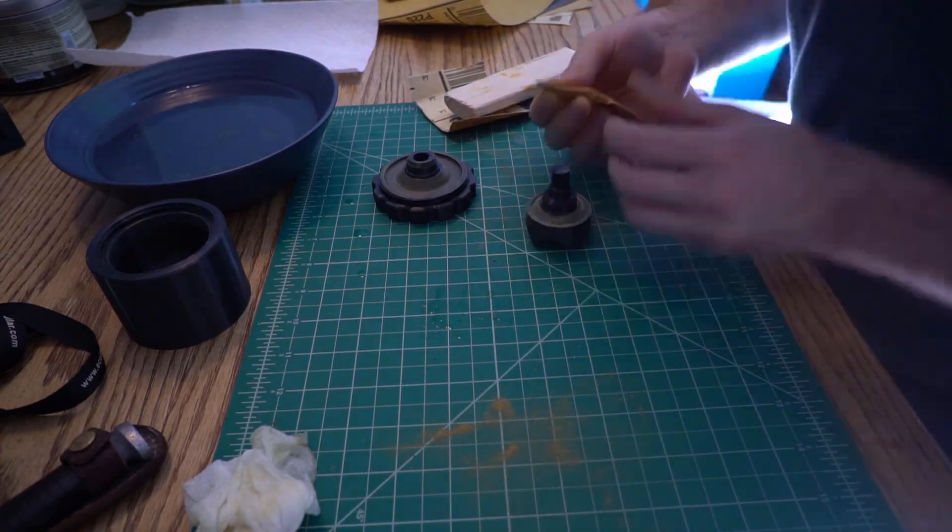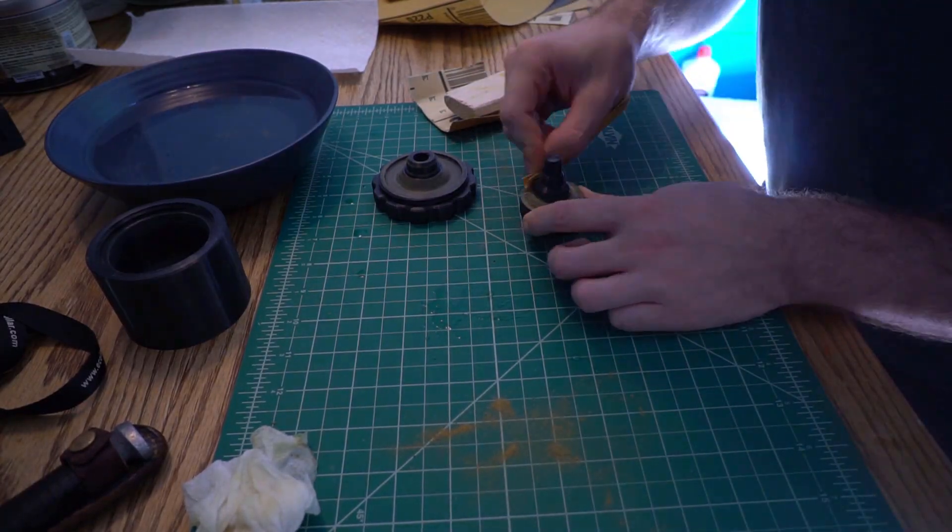Got one though. That's a bit of a bummer, but the post-processing on the resin molds was on a completely different level from the FDM printed molds that I've done in the past. The older molds took hours of sanding and needed a good amount of paste wax to fill in all the voids and scratches — really irritating, tedious work. This mold was post-processed in probably an hour total, including waxing and buffing, and that just feels like a huge improvement process-wise.